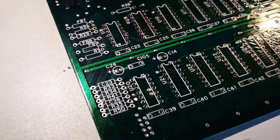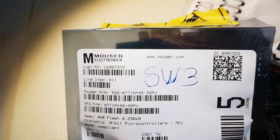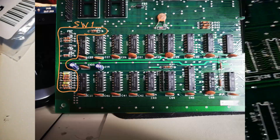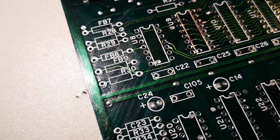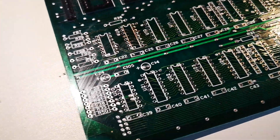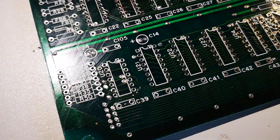So I'll just desolder this. When I started I used my 60-watt desoldering iron and that didn't go very well, so I started using the temperature-controlled iron — wow, much better. I used a hot air gun to remove the pins or the ICs because I don't have a desoldering gun. Works perfectly.